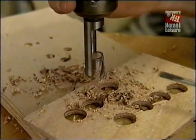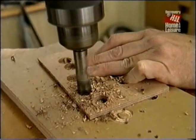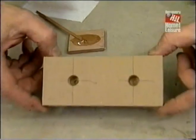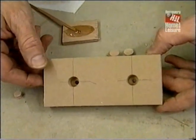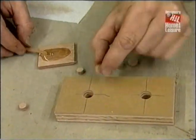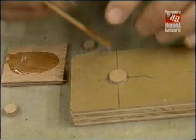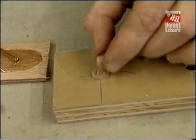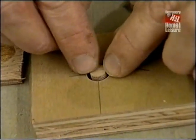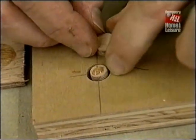Now for a little assembly — I'm going to take the side with the figure and actually glue and nail that to the poplar block. On the other side, I want to be able to remove it for mechanical reasons, so I'll attach it with just screws. I need to make some pulleys, so here I'm using my plug cutter to produce some discs. Here I've switched to a smaller plug cutter for the center of the pulley. To assemble the pulleys I made a little jig — a piece of 3/4-inch plywood with half-inch holes that go 5/8 through and small holes that go all the way through. I'm using an epoxy glue, a quick-setting version that sets in 5 minutes — it's waterproof and strong.